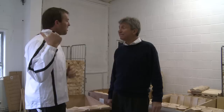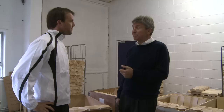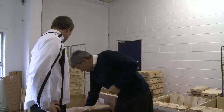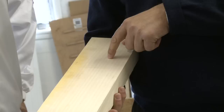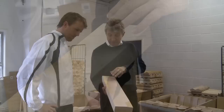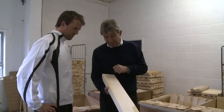So we've left the molding room and now I've entered the grading room. Each batch of wood comes through here and the bat maker looks at each individual piece to determine how good that piece of wood is. Let's take this one for an example. It's a pretty exceptional piece of wood actually — there must be 15 grains on there across the face, all evenly spaced, so that'll play particularly well. The grade will also determine which end the handle should be. Obviously the handle end doesn't hit the ball very much, so the important bit is to get the best bit of wood in the driving area.